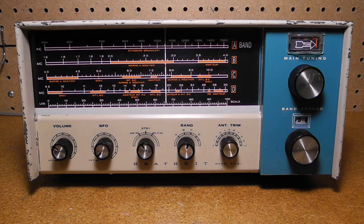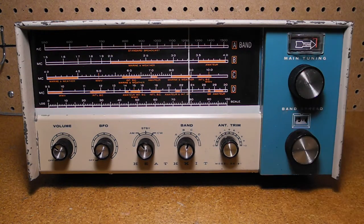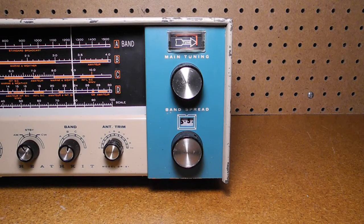The front panel features a 7-inch illuminated slide rule dial. The dial is marked with various bands, including amateur radio and shortwave broadcast, as well as the time and frequency standard station WWV. It also has a 0 to 100 logging scale. At the right is the band spread dial. If you're not familiar with band spread tuning, it's a secondary control that allows more accurate tuning of closely spaced frequencies on a radio band. On this radio, the band spread is uncalibrated, marked only from 0 to 10. Typically, band spread is needed to tune single sideband or Morse code signals, and on the highest band where tuning is the most crowded.